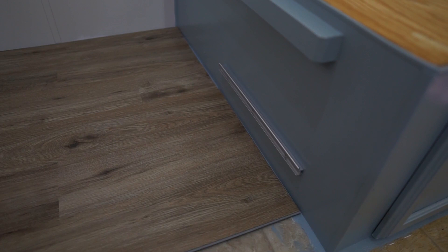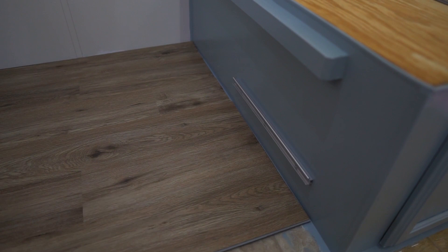All the while we're keeping about an eighth to a quarter inch at the edges so that this floating vinyl plank can shift a little bit without being constrained by the cabinets. Those gaps will be covered up by the half-inch quarter round. This is all pretty straightforward and easy to lay — you just have to figure out what your measurements are for your specific camper.